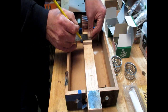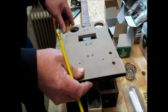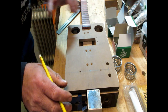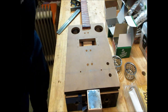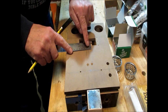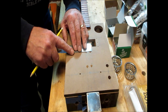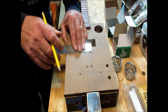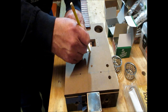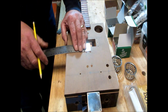The next thing is to know how wide the neck is — it's about 40 millimeters, which puts the center at about 20. That way when I put my lid on I've got a mark there and a mark there and I know where the center of my box is. I want to measure off that center line — I can't go 10 or 20 millimeters out because I'd be at the edge, so in this case it's about 7 millimeters from the center line each way.